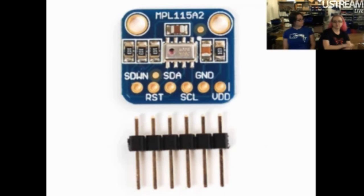The only thing is that it's cheaper because it's not nearly as precise — it's 1/50th of the precision. Instead of being able to measure around 0.1 hectopascal, it's like 25 or something. So it's not good for altitude detection. The BMP-085 is actually precise enough to calculate your altitude based on sea level barometric pressure, which is awesome. This sensor isn't good enough for that use.